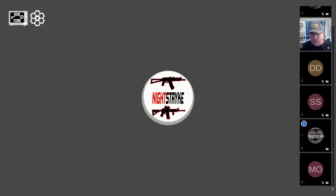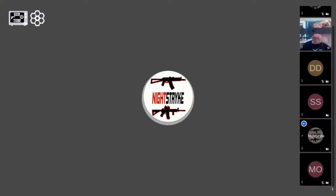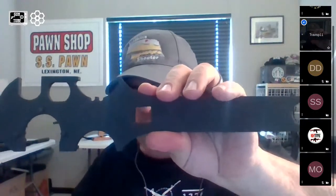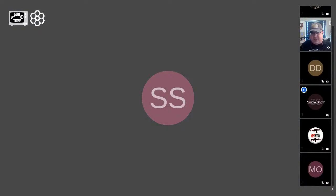The armorers wrench: the Magpul armorers wrench is about $70. You can get an NC Star one for about $15. I paid $40 for mine — a DPMS armorers wrench. This is going to help you tighten the castle nut on the rear when you put the buffer tube together. It makes that process a lot easier. This wrench weighs about three pounds and I haven't bent any tabs on it. Spend $20-$30 on a couple of tools and your life is much easier — even if you think you're only going to do one build.